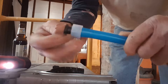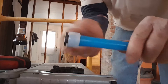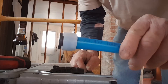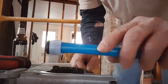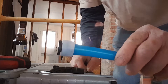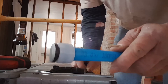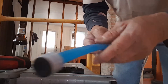This is just a plug — you take the plug or whatever fitting. I waited just a little bit too long and you push it in there. See, it didn't go all the way — maybe a sixteenth of an inch gap in there. But basically if you expand it all the way and then grab your part fairly quick — sometimes you got to go really quick, other times you have more time. That holds water. I usually let it set about 30 seconds to a minute before I put water into it.